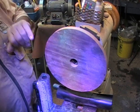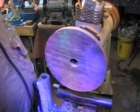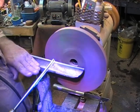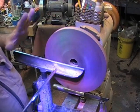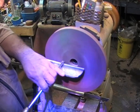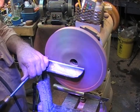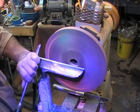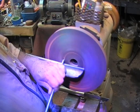This side I'm going to do a different way than I've ever done one before. You're either in for a treat or to watch a donut go flying. This time my intent is to put, instead of dishing this over the face, I want a capturing light mode. So I want a depression in this area. So I'm going to remove some wood. Now, this is early on, so we can just go ahead and do some pull cuts, right? But we want to be conscious of the wood.